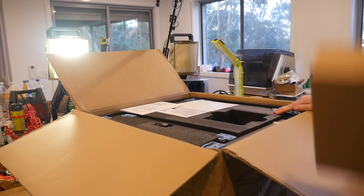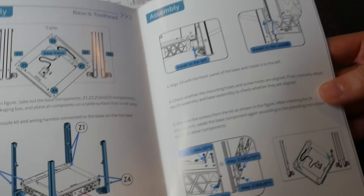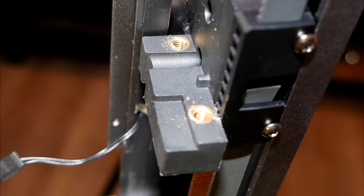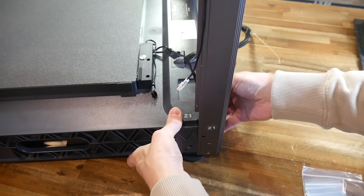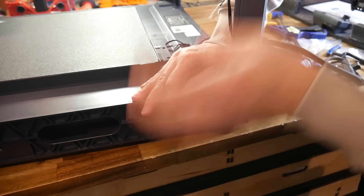I'm going to be very brief here as this isn't a full review. From unboxing to first print, this took me around about an hour. Tools I required were included, and the manual did a good job going through the assembly steps clearly. Upon initial inspection, there were a few components that didn't exactly inspire confidence. While one side of the printer slotted together perfectly, the other two corners seemed to be too tight, seemingly because the injection molded panels didn't quite line up with the internal extrusion.